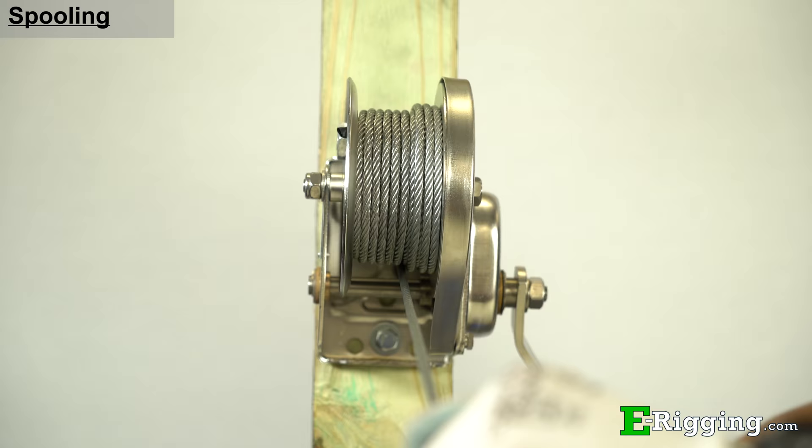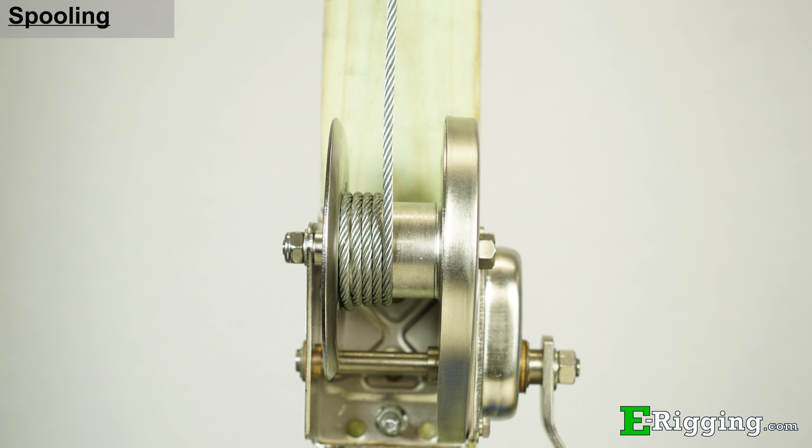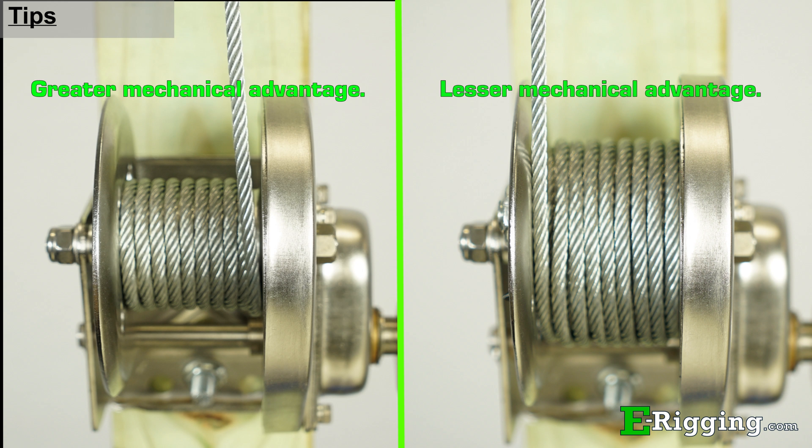Continue applying cable until the cable is equally distributed across the spool. The minimum amount of cable wraps on the spool at any given time should always be four wraps to maintain its proper load holding capacity. The maximum amount of cable on the spool is determined by the cable diameter — it must sit two diameters below the portion of the reel where it starts to angle outwards. Visit the hand winch section of our website to see a table with the maximum length of cable you can spool on the winch in various cable diameters. Keep in mind that the greatest mechanical advantage and the lowest force required to pull a load is achieved when you have the fewest layers of cable on your winch, so it is a good idea to keep the shortest length of cable on your winch that will still work for your application.